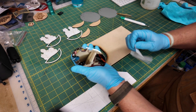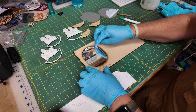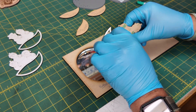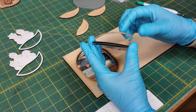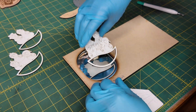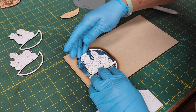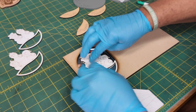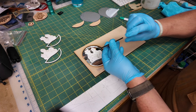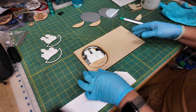I'm going to put them together now. A quick suggestion, especially when it comes to ornaments: don't be as rough as I am when cleaning them because you've got really tiny pieces. Second, if you're working with acrylic and assembling your pieces, try to always use gloves because acrylic will show every fingerprint — every one of them. And lastly, if you're making production pieces that you'll be making over and over again, just take a few minutes and make a jig. That way every piece is high quality and all of your layers are exactly square, and you don't have to worry about eyeballing it before your 3M sticks.